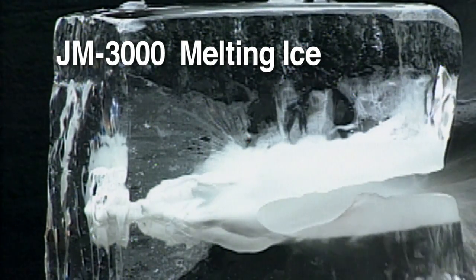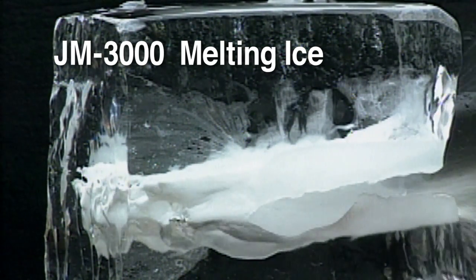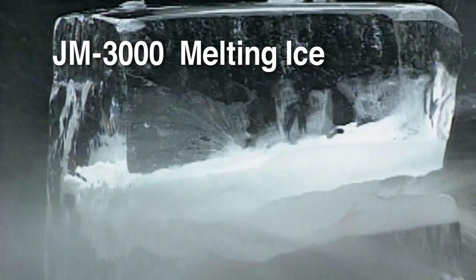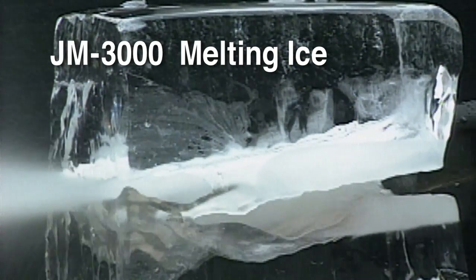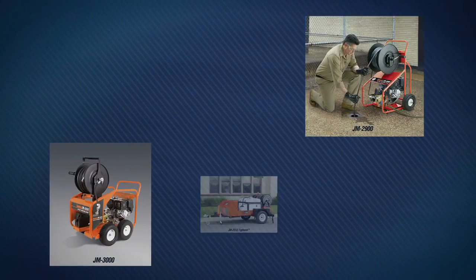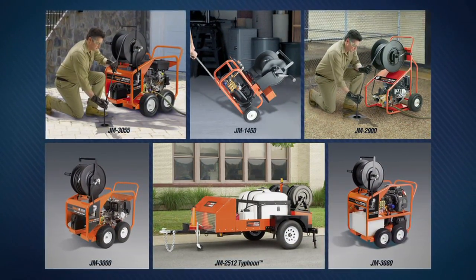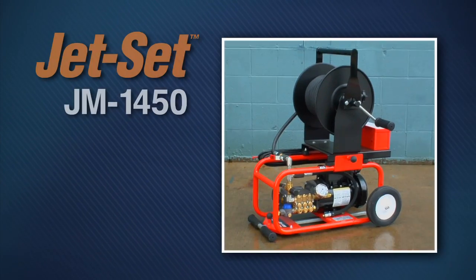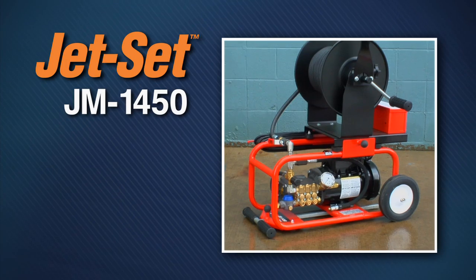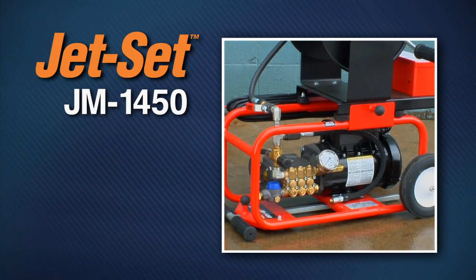Just the unheated water from the nozzle is powerful enough to slice through ice blockages. A 3,000 psi gas jet can clear a frozen 4-inch line at nearly 1 foot per minute. With a wide range of models to choose from, General has a jet to fit your needs in almost any situation. The powerful JM 1450 electric jet gives you as much pressure as you can get from an electric jet.